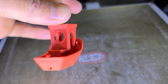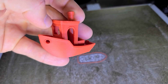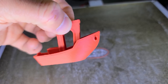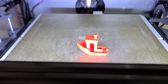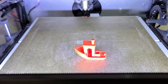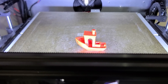So that was it. It can be better. I guess if I try with PLA, it might be a better candidate for better quality. But this is not too bad. As requested — benchy, outer walls at 100 millimeters per second, like people wanted to see. I'm pretty sure we can get better wall quality with higher speed, like maybe 200.